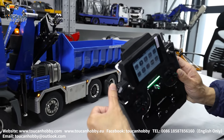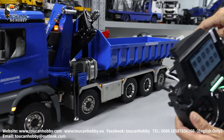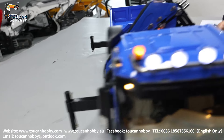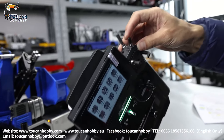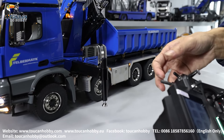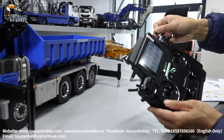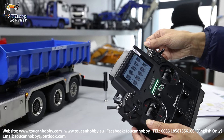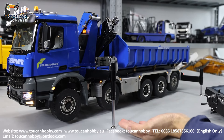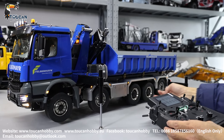SWC is now operating the arms of the legs, first reaching out. The right side is coming at the same time. All in position, stop. SWC is now dropping the legs — legs come down, SWC pushing forward. After the support is in place, we can operate the crane. For safety, you can see that when rising, it will rise the entire chassis — that's the hydraulic legs with enough power. All up.